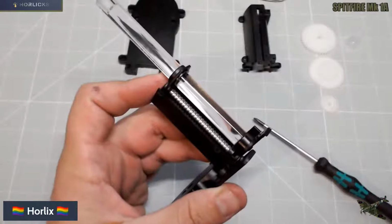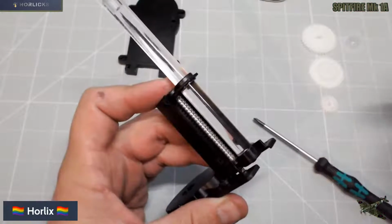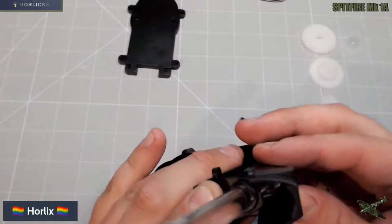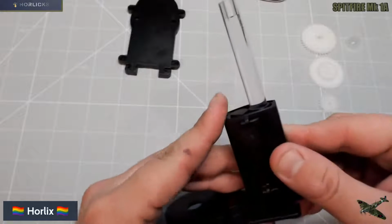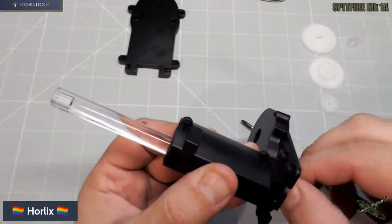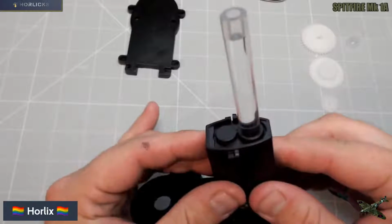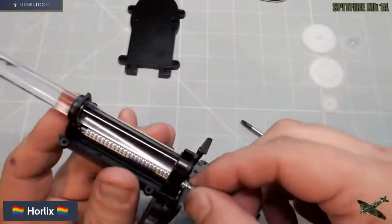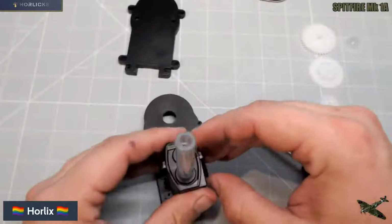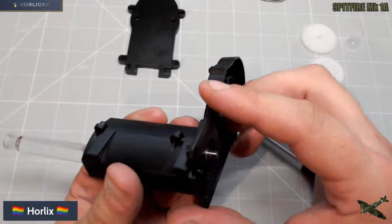Take the second upright housing part, 8104, and fit it in place against the housing part, 8103, so that the rod assembly is held in place. The screw holes in the tab on each side of the housing pieces should be aligned, as indicated by the red arrows. The large tab on part 8106 circled fits into the slot in part 8104 circled. I think we've gathered exactly where that goes. So long as you line that center slot up with the tab that comes out, and you line the top and bottom up and the screw holes up, we can move on to the next step, which is step 9.